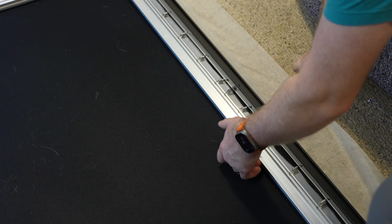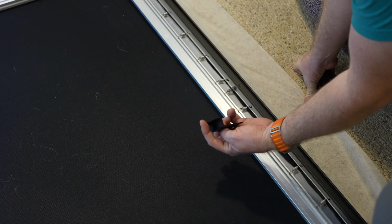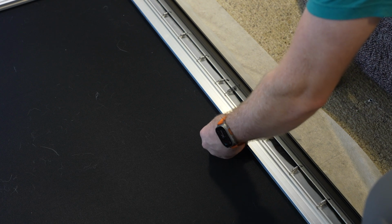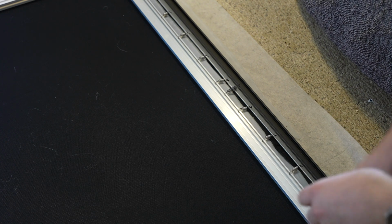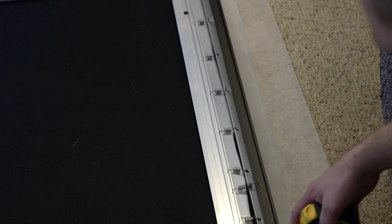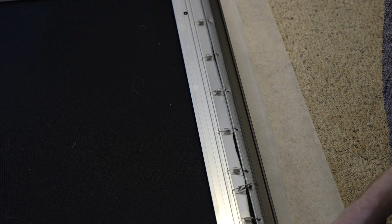And there's actually a little groove up in there that this edge seats up into, so it can't be pulled into the screen or anything like that. So that's where we're going with this guy. Now the one thing I want to do is figure out where this bracket's going to be in terms of height. So I need from the top of this to the very top of this edge at least, I would say 4 inches would be perfect, because it gives me about 1/8 of an inch extra.